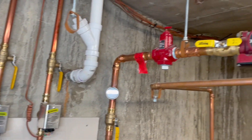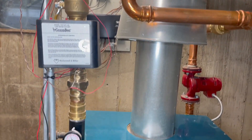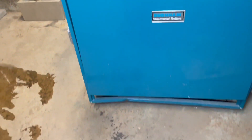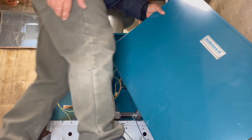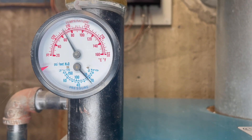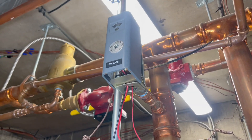As I said, if you want to see a video on step-by-step installation, go to my channel and look for that video. Again, this is a Burnham. Burnhams usually have the low limit control right here. So we're going to remove the cover. You see here, we have the temperature — it's 160 degrees right now. We just want to bump it up a little bit, maybe to 170, about 10 degrees more. And that's our high limit — we'll go there in a minute.